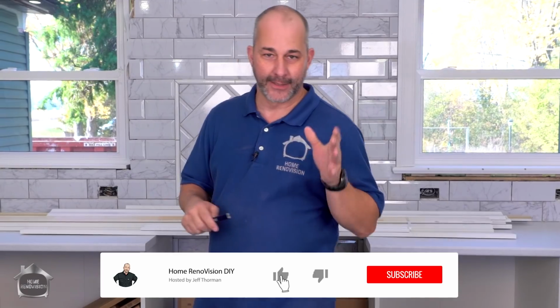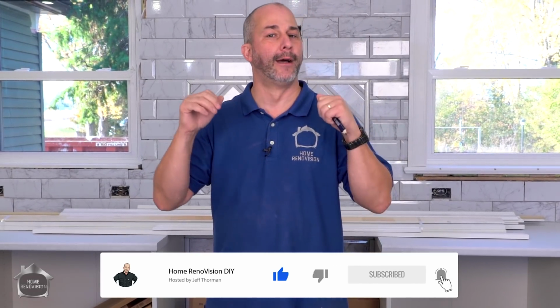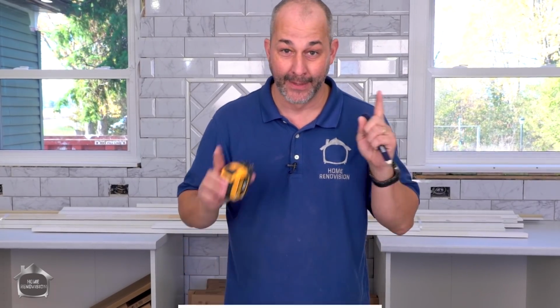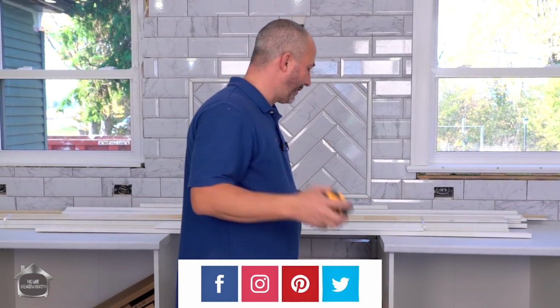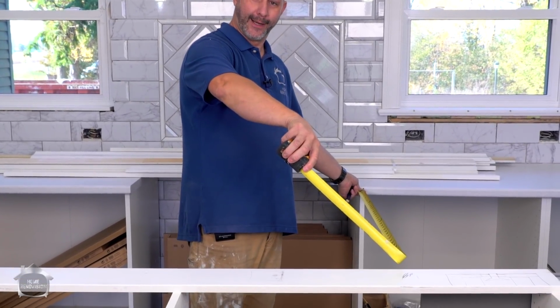Let's get into this. Step number one is to know your space. Now what I mean by that is understand the basic design rule, okay? And that is 40 inches. You want to have 40 inches from countertop to countertop when you are designing an island.